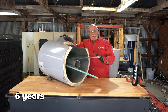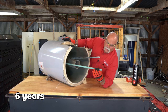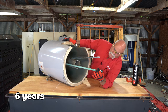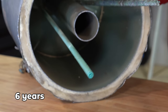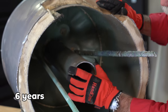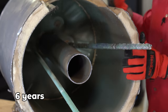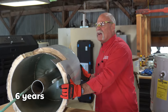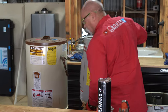The anode rod may have been replaced — I'm not sure. The cold water inlet tube has some assembly at the bottom that makes it spray out, which helps keep the bottom clean. You've got the flue right here in the middle to carry the exhaust gases up. This is what the inside of your gas water heater looks like. Now let's look at the electric one.